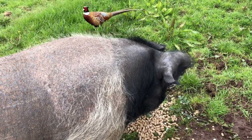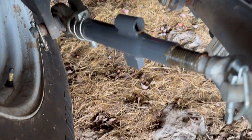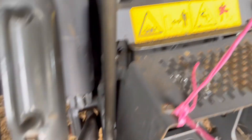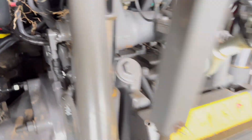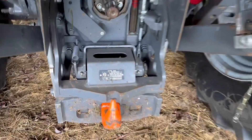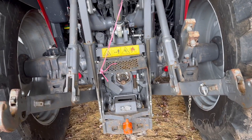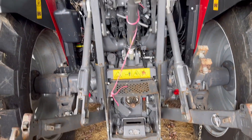There's our Bono - good lad, enjoy. You know, just greased up the arms, some grease points. In there you can see it on the PTO shaft as well. These little lugs down here as well, these have been greased - just giving it a little bit of a grease up to make sure it's all right. And we'll go down and grease the flail when we go down to check the farm.